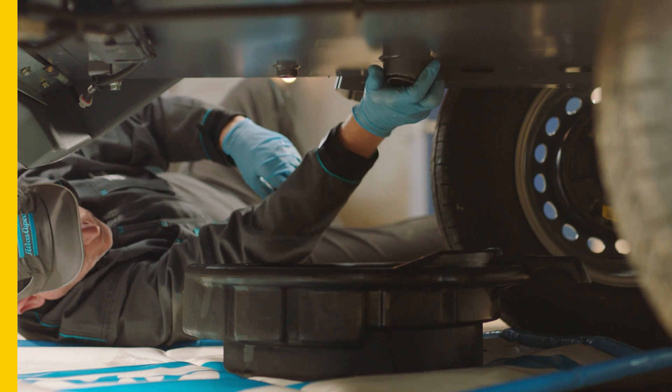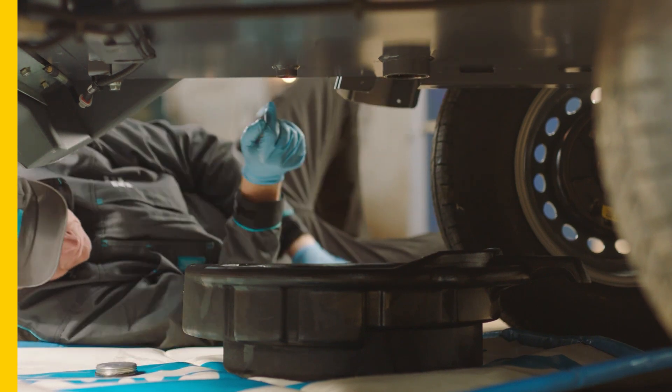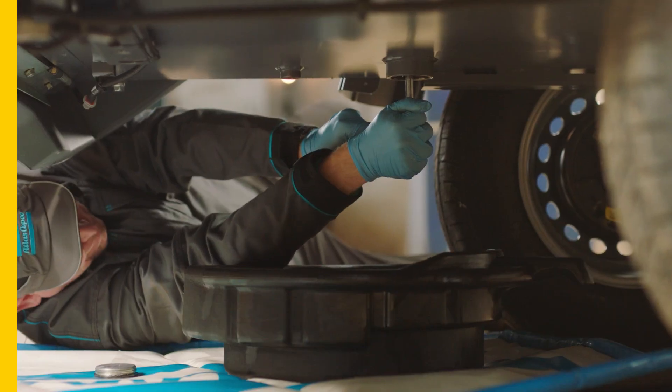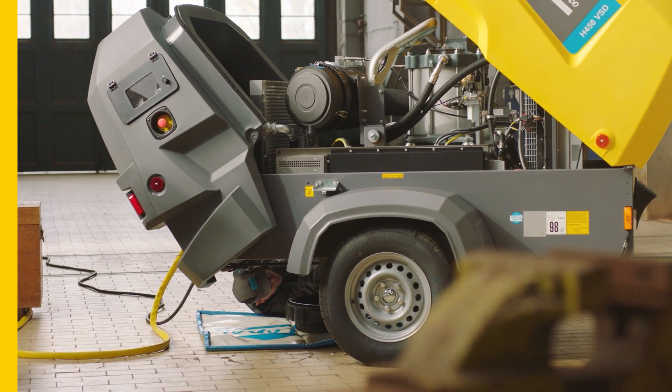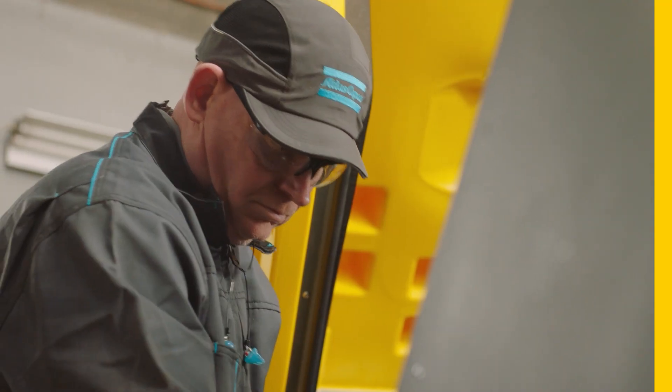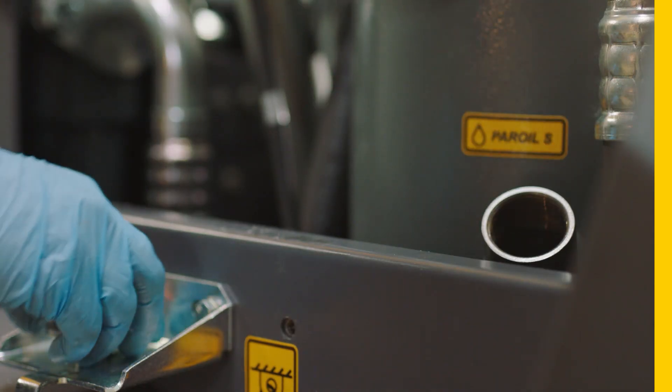At the underside of the machine, remove the frame plug so that next you can remove the drain plug. Drain the oil and collect it in the oil pan. Completely unscrew the filler plug on the side of the vessel to speed up the draining procedure.